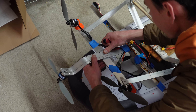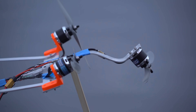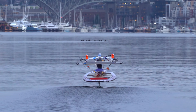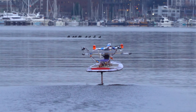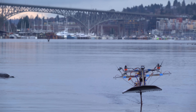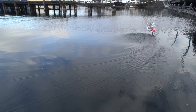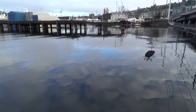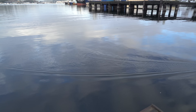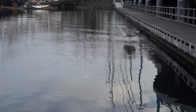So it's back to the workshop for yet another modification — we got an extra motor today. By distributing the thrust between the upwards-facing motors and the downwards-facing motor, we now have pitch control. At this point, it was working as well as I could ever hope for. I definitely have some pitch control with the elevator now, which is nice — that's the front motor doing its work. Now we can take a deep breath and appreciate the beauty of the hydrofoil. It's really just so smooth and there's almost no wake compared to a normal boat. One thing I noticed watching some of these clips super closely: there's a wake from the mast slicing through the surface of the water, but there's also a larger, more distributed wake from the foil displacing and moving water — that's what's causing the larger but super subtle waves behind it. Pretty cool to see.